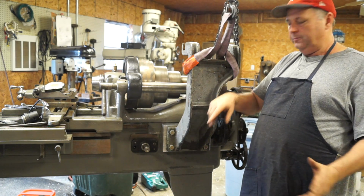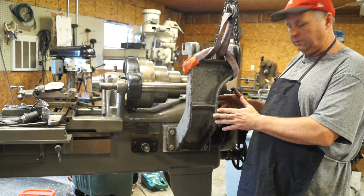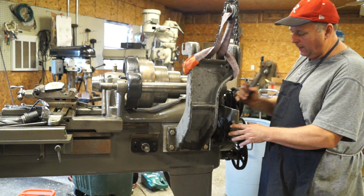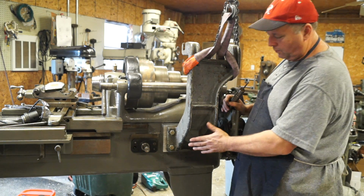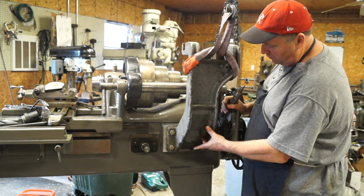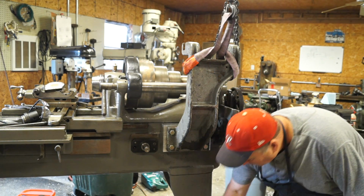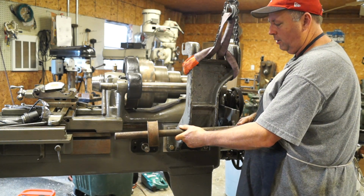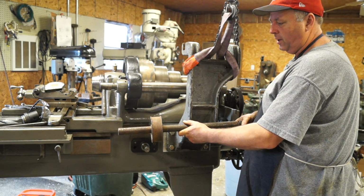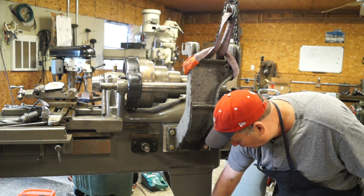So what I've decided to do, like I said, I've already mounted a plate. I've pushed my motor mount out 2 1/4 inches, and I'm going to basically bore through this mount in line with this bearing and drive that relieving attachment. So basically you just have the drive shaft coming through here. Now that drive shaft, as it's working, it has to articulate a little bit. It's according to how far the taper attachment goes back, or whether or not you're cutting a taper with the relieving attachment, and a few other issues.